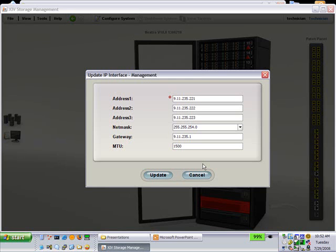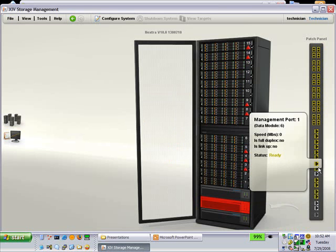Well, as I'm saying, with shock, we get service calls regularly, probably once a month, saying, how do we change our IP addresses? We can't find an interface. Previously it was a customer changeable parameter. So I'll open a defect and say you can no longer do it from admin, but you have to do it from technician. The customer's only supposed to log in with admin. Correct. The technician password is going to be changed at GA to something less obvious than technician. But it'll be documented.